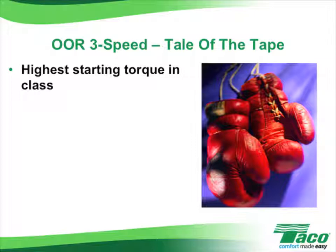circulator from binding up due to dirt or iron oxide buildup during idle or downtimes. In the United States, systems often tend to get a little cruddy inside, and this crud can cause certain circulators to seize up after a period of downtime, like during the summer. This debris can build up in the cartridge and cause service issues, particularly if a circulator is operating at low speeds. The 00R doesn't have that problem. It has extremely high starting torque to prevent that particular service issue.